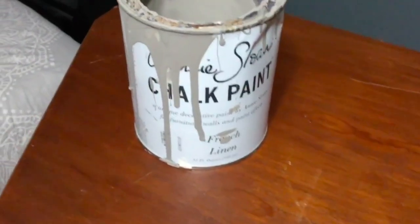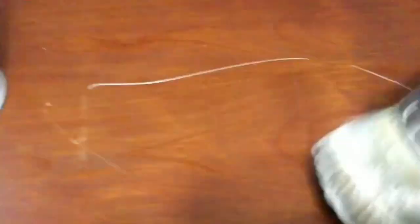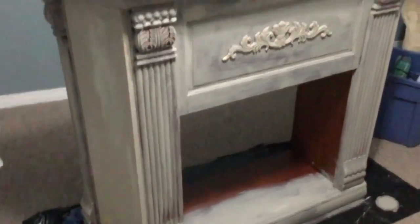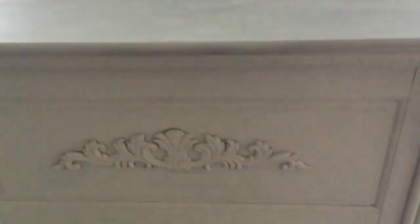It had shelves on the side and had no real character, so I ended up buying a little decorative piece that I glued in the middle and then had my husband put up boards to close up the spacing where the shelving was on the side. I used Annie Sloan chalk paint to refinish this project — I used French linen to paint the whole fireplace. I don't do 100% coverage; I put two coats on top and one coat for the rest of it. Then once the paint had time to fully dry I created a wash with graphite, which is the darkest Annie Sloan paint there is.